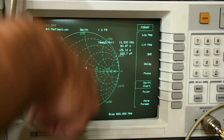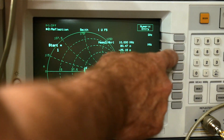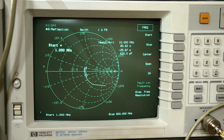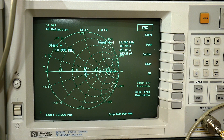On the Smith chart you can see it's moving quite rapidly right at 10 megahertz. Starting from 1 megahertz it's way off, confirming it's spec'd at 10 megahertz — don't use it below 10. From 10 to 500 megahertz it's within spec, and it's over-producing on dB gain. I like it.